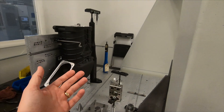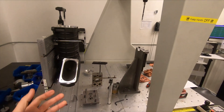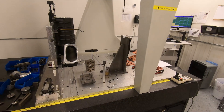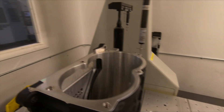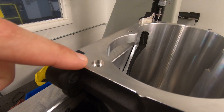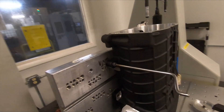You can see right here that the Gen3R is set up on this plate. It is mounted inside this huge CMM machine and we are going to run the program that goes through and checks critical tolerances. These holes are really important because they line up the bearing plate so the rotors are positioned correctly in the bores of the supercharger housing.